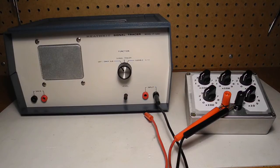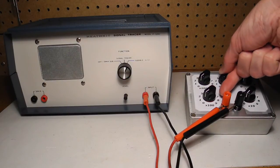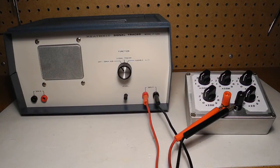The final mode is called audible volts per ohm. In this mode, the signal tracer produces a tone that varies with either the voltage input to the test probes or the resistance between the probes. It operates over a voltage range of approximately minus 3 to plus 20 volts DC, or a resistance range of 0 to 5 megohms. Here I have the unit connected to a resistance decade box, which I'm adjusting to different values. The frequency of the tone gives an indication of the approximate resistance or voltage. The manual lists one application of this mode as checking digital logic circuits — a 0 or low voltage can be easily distinguished from a 1 or high voltage.